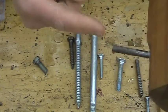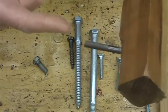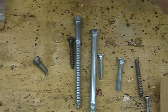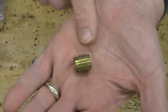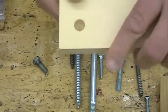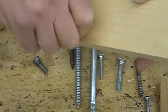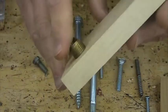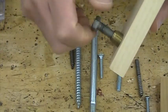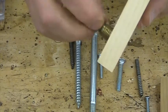That gives you a permanent machine thread on something. But what if I wanted a permanent metal internal thread? That hanger bolt is an external thread — what if I want an internal thread? The next thing is called a threaded insert. It's got a wood thread on the outside and a machine thread on the inside. What I would do is drill a hole into a piece of wood and screw this down inside until it's flush, and leave this in the wood forever. Then when I wanted to bolt something in, I now have an internal thread made of metal. This one happens to be brass, and I can take it apart and put it together a hundred times.